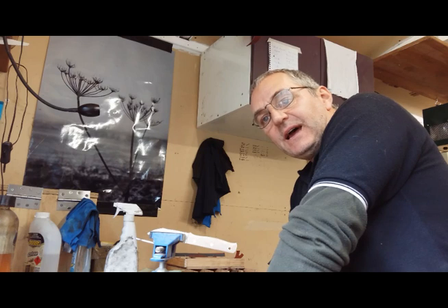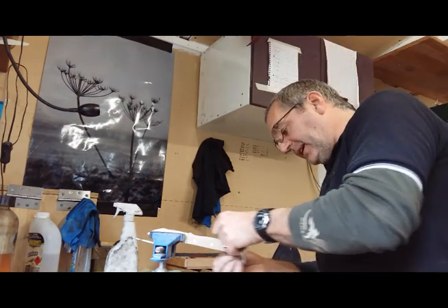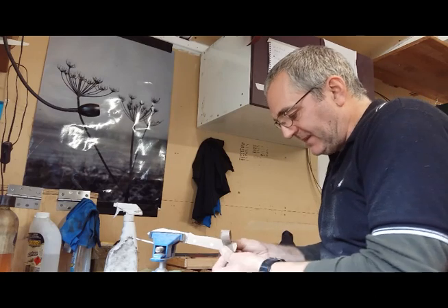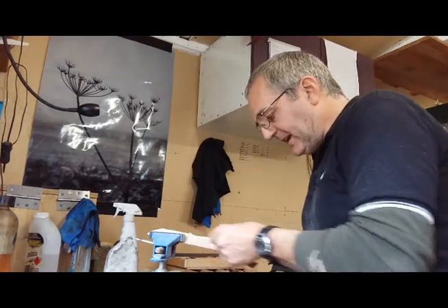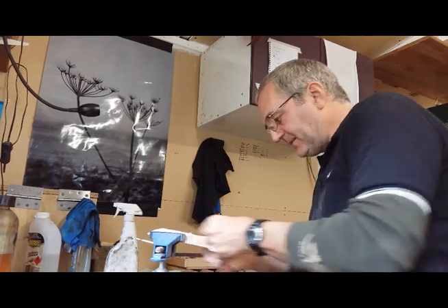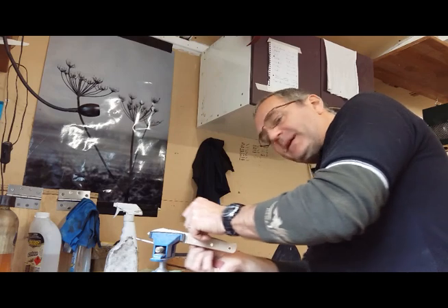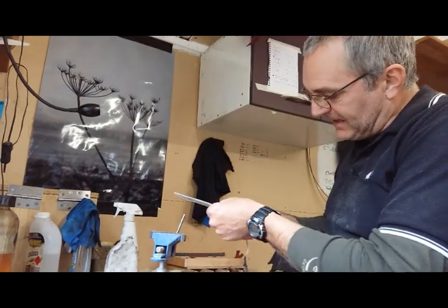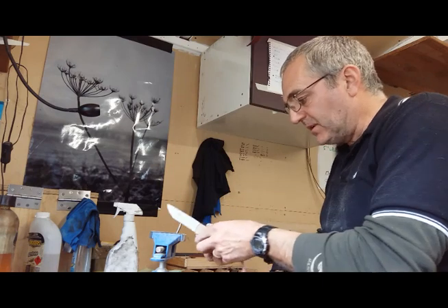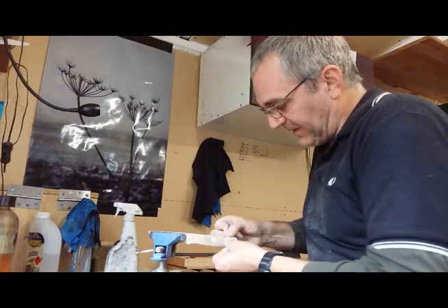Otherwise, you'll have spent days and days and basically end up with a fancy looking piece of pry bar or a club. It's okay watching guys who do the forging and make bloody good knives out of all sorts of things, but chances are they've had quite a bit of practice and have developed a good reasonable balance in heat treatment. Because at the end of the day, if the knife won't perform — look at what's out there, don't try and reinvent the wheel. Then the second point is: spend plenty of time on the fitting of the handle. Get the tang flat, get everything flat, work to them being flat. Use good glue. Don't skimp on the glue — it's not that blooming expensive. Get yourself a good handle on there, because that's another thing that lets the knife down.